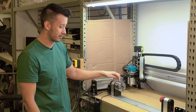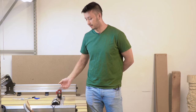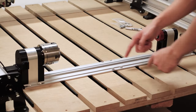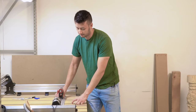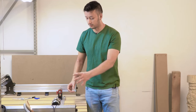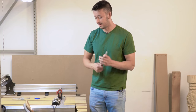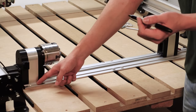We'll next move on to the Y probing after that. If you've laid out your track and you have T-tracks or other wasteboard items — as you can see we've got here — and you've noticed interference on one of these holes, this section is going to cover that. You can see our two left holes in the middle are colliding with our T-track, and if we want to shift it, it's not going to work that way either. We're kind of forced to use these sets of holes to mount this properly. To do this, instead of drilling all six or all ten holes at once, we'll be drilling individual pairs. So we'll be doing these two, and then these two one by one. To facilitate that, we're just going to be marking each set individually instead of one pair.